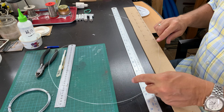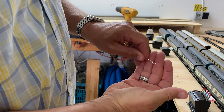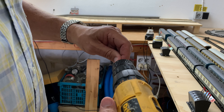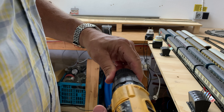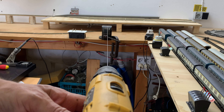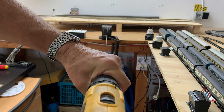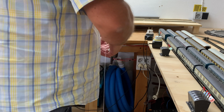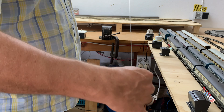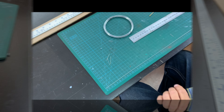As you can see, the wire obviously doesn't want to conform to a straight line. Using a little technique I learnt from a couple of other people online, I've secured one end into the jaws of a vise, bent over a little section at the other end to fit into the chuck of my drill. Once that's secured, tension is applied — not too much — and about 10 to 15 seconds of fast spinning will actually tension the wire to form a really straight length. It holds its shape and put along a straight edge it's held a really good straight line.